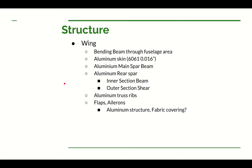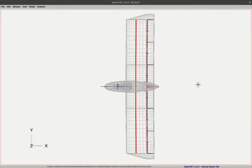You can start your structural design just about anywhere; I'm going to start with the wing — really the main structural component of our airplane. Dan talks about several ways of handling wing load into the fuselage. We're going to use something similar to what he calls the bending beam. Our entire center section of the wing is going to have a bending beam for the main spar, and I've decided to do a bending beam for the rear spar just on that center section as well. The reason for the rear spar bending beam is because of our tail booms — there's going to be quite a bit of torsional moment caused by those tail booms in pitch, and I want a bending beam for the rear spar that can handle that.